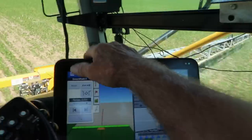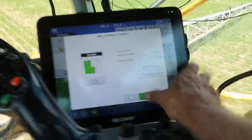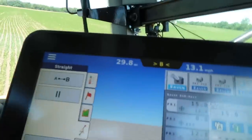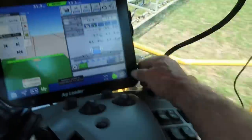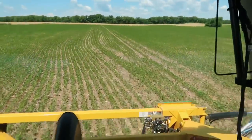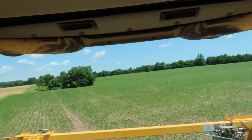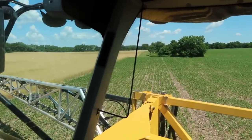I'm gonna reset my A-B line here, get a new one, go to the straight line — that way I can mark a straight line through here and it'll do a lot better job. Mark A, come through here as far as we can — just a little bit of lap right here — then I mark my B, get my auto steer, and that turns green. Hit it, and it'll steer itself now it's marked on that line. I'll just make one around — I can hold my boom out over the wheat field, shut it off and it won't spray.